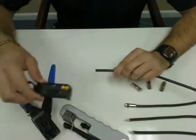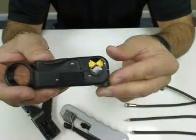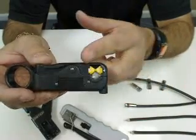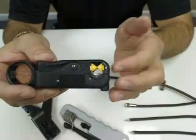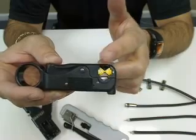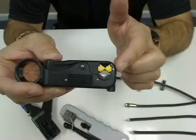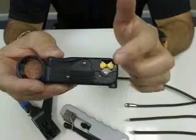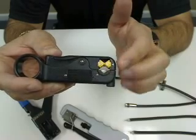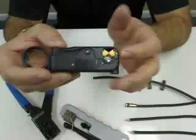Your next step is going to be to use an inexpensive prep tool. In this case I have a prep tool here that will prep RG6 and RG59. If I was to prep coaxial cable RG59, I simply remove this, turn it, reinstall the little tab and align the arrow to the actual coax cable that I'm about to prep. In this instance you can see that the arrow is set to 6, which is ready to prep RG6 coax cable. So let us begin the process.